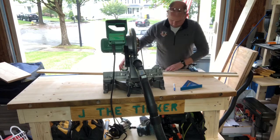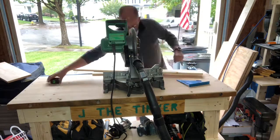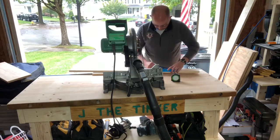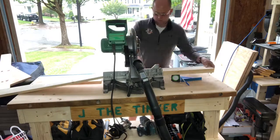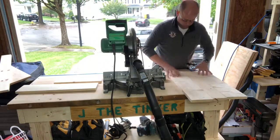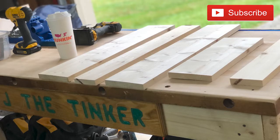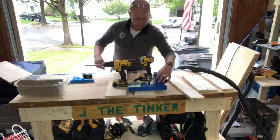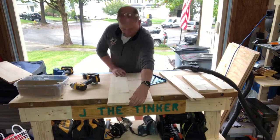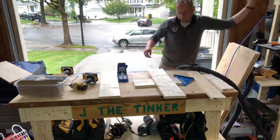Let's get into it. I purchased the needed wood for the project, just two 1x6 cut down to 25 inches, one 1x6 cut down to 14, a 1x4 cut down to 25, and a 1x4 cut down to 14. I should note the 14-inch measurements were cut down further as the project continued. Lay out the pieces. Do they fit? Mine did at first. All the tools you see in this video, past and present, can be seen or found in the link in the description below.